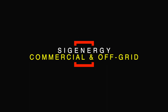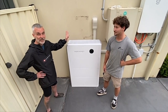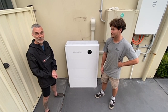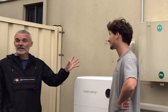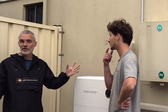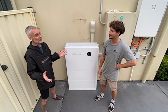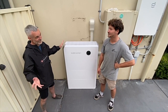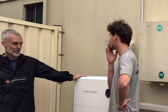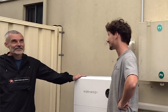It can go very big — we've got a lot of commercial projects. The backup gateway has two versions: one is a home version with a generator input, and you can do it off-grid. We've got some of our off-grid guys going out and doing bigger projects. The gateways have single-phase and three-phase versions, and at the moment they're custom-building commercial gateways, but there will be commercial gateways off the shelf later this year — ones that'll take four inverters and ones that take six. Currently it's two inverters per gateway. One of our off-grid guys is doing three of these 25 kilowatt inverters with 12 batteries, but we needed to custom-build a commercial gateway for him — we'll do a video on that in the coming month or two.